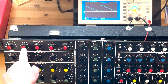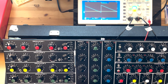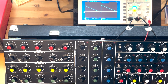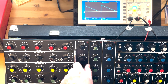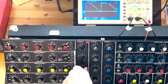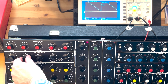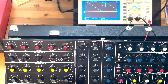Then finally the tuning knob — no big deal, but of course it's important to tune the oscillator. Continuing the signal path into the mixers: the Maplin is very sensitive to running the mixer too hot. If you add another oscillator and start going red, it'll distort and may also choke the power supply, so try to keep it in check. You can use this LED when tuning the oscillators to see when they're beating together, but when running it you should lower the main volume so it doesn't distort too badly.